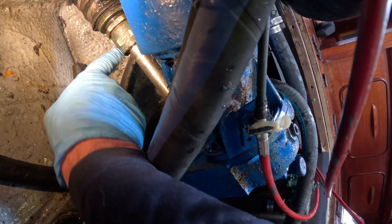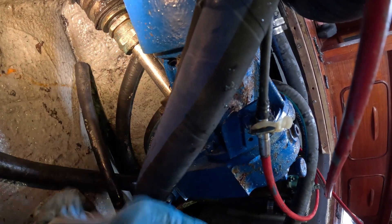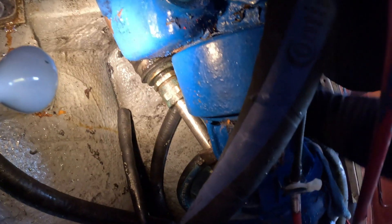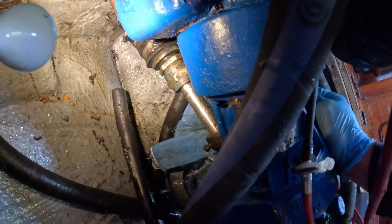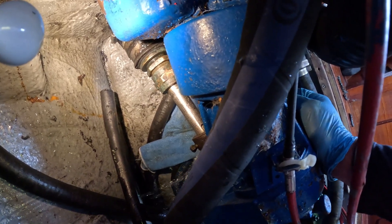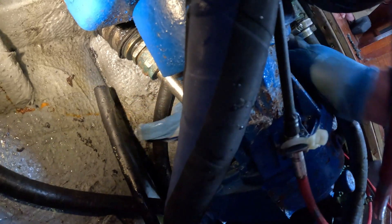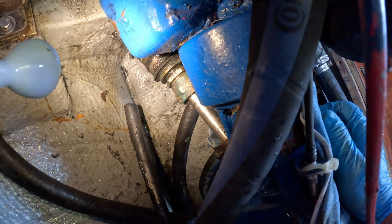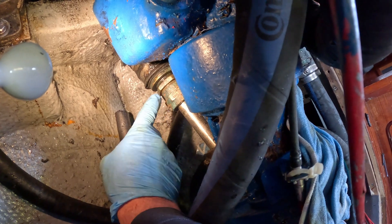Now what we're going to do is back this nut off again. The easiest way to do that is grab yourself a towel because it's a little wet and greasy — that'll help you grip it. We'll see how it's moving, and then of course it's going to start leaking again, but we need to get like three strands in there. Because we greased it, the packing is not coming out when we're undoing that nut — it's staying back there.